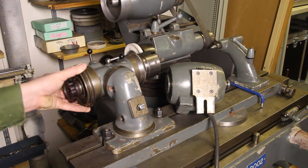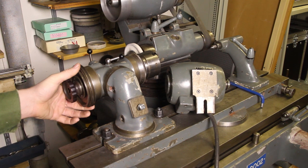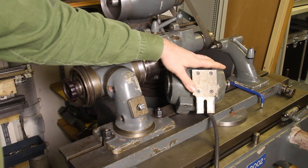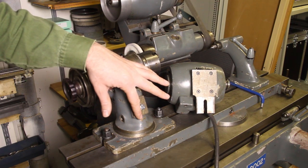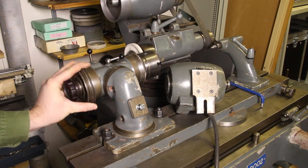The purpose of this pulley is that you can use the Tone grinder as a cylindrical grinder, and that is done by using a motor. This is the original Tone three-phase motor that attaches to this surface here and drives this spindle by means of a belt.